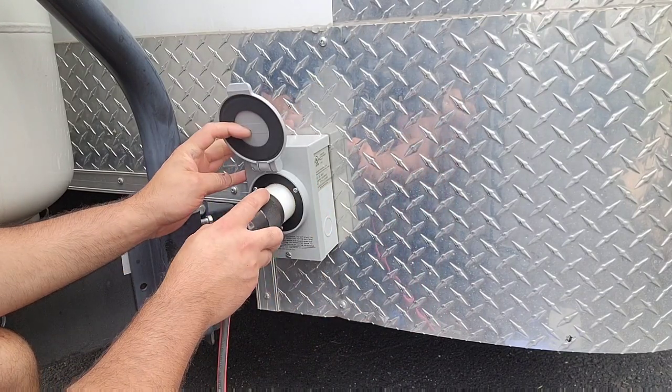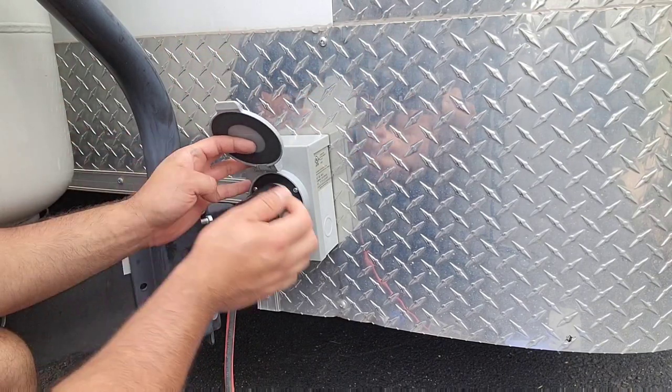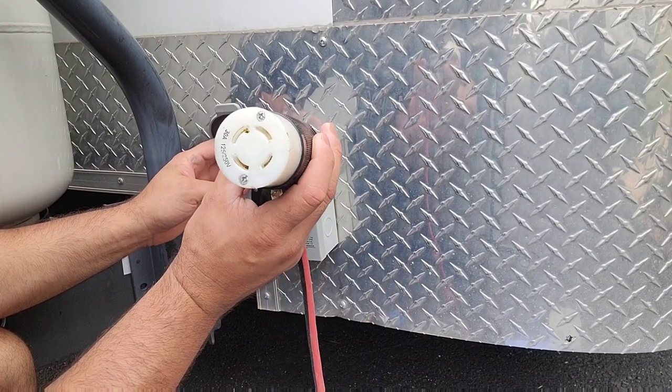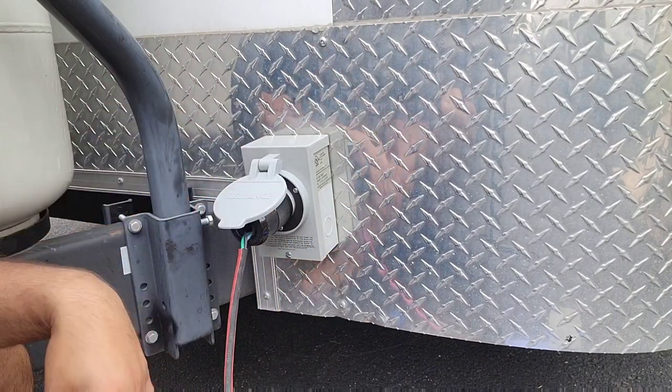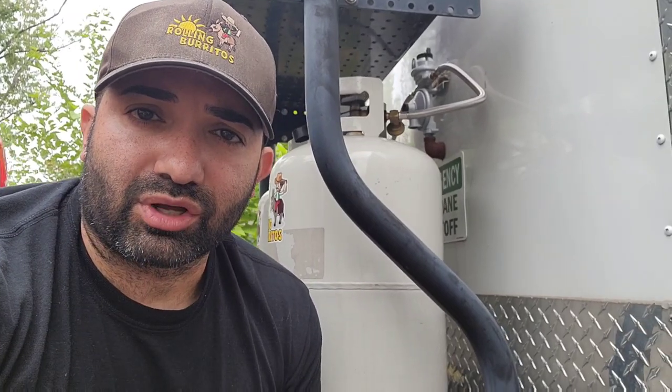If you do it yourself, look at that — it's already done. Connect the power and make sure it's connected to the right terminal; you should hear a beep. There it is — I did connect it. It was the Y. This plug I made at home is just a 30 amp plug connected here. When I bring the trailer back — boom — that's how you replace or install a brand new one. Same wiring: hook one cable to X or Y, keep the same terminal on the plug and on the generator plug. Use X and Y together for 240.